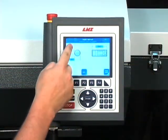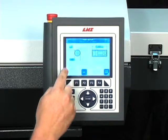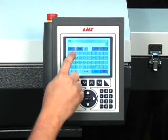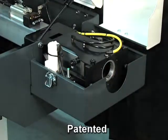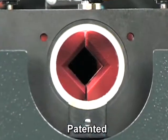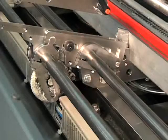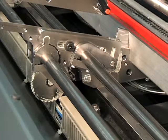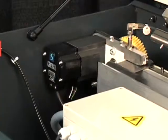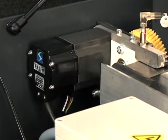Using the prompting remote controller, simply enter the bar stock shape, diameter, part length, and guiding channel ID. The patented Hydrostatic Outboard Bar Stabilizer then automatically adjusts to bar and pusher diameters, while the bar selection fingers automatically adjust to the new bar stock diameters. The servo drive, with Absolute Encoder, automatically optimizes torque and feed rates.